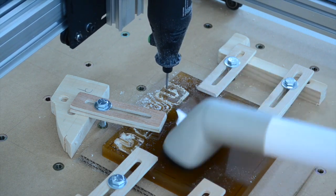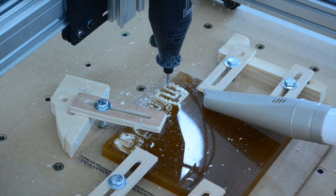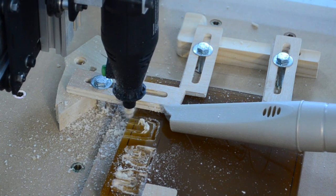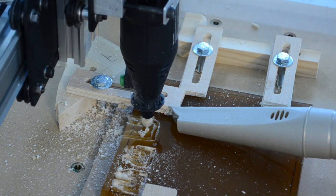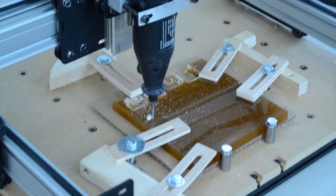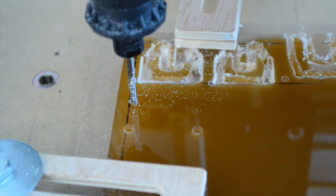Here's what went wrong. Firstly, because polyurethane isn't a very good conductor and rotary tools don't go very slow, the heat generated during milling stays very close to the exposed surfaces. This led to melted rubber clinging to the end mill until it reached critical mass and was flung off into every corner of the room. Secondly, because soft materials deform so easily, as my cutting depth approached a quarter of an inch, the top edge of the material was often pulled into the end mill and mangled. I tried freezing the polyurethane overnight to stabilize it, but that didn't help nearly as much as I needed it to. In the end, I was able to mill out a U-shaped profile with thickened arms by cutting to a depth of 0.25 inches on one side, flipping the polyurethane block over, and milling the same pattern again. I used two holes drilled an inch apart as a guide so I knew the correct starting point for the end mill on each side.